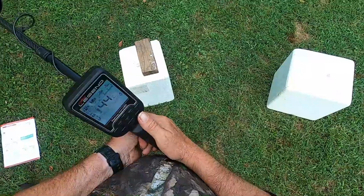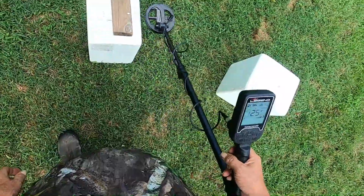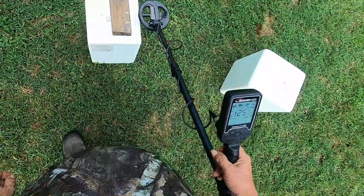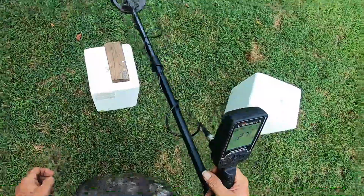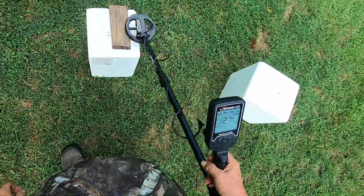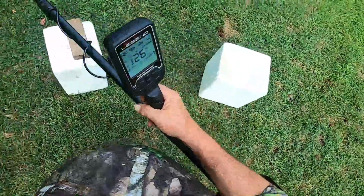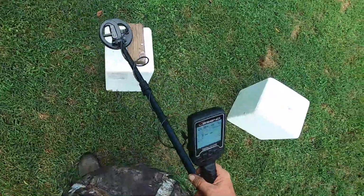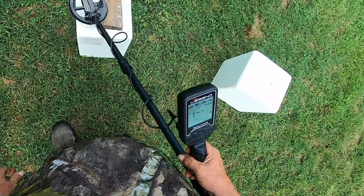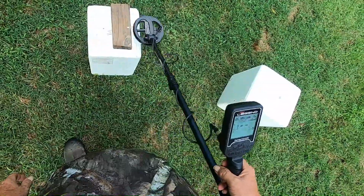So you got to hear that, down close to the foil. Okay, so we'll go to 4 kilohertz. Okay, I get a two-way signal. I get 25 in the meter. That's not bad considering that's 4 kilohertz. Here's 10 kilohertz. So I get a better signal with the coil closer to the foil. 15 kilohertz, let's see what happens. 25 in the meter, so it's reading 1 point less generally than a solo nickel, which I can take. That's acceptable to me. 20 kilohertz. It's a louder signal than it is in multi, I believe. Okay, 40 kilohertz. I wouldn't expect anything earth-shattering there.